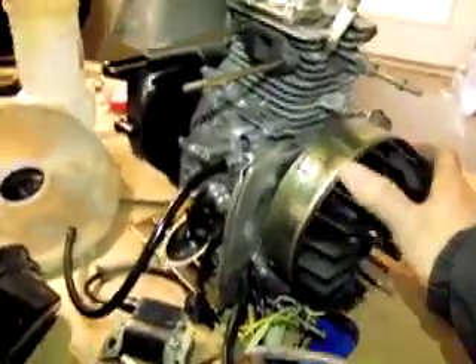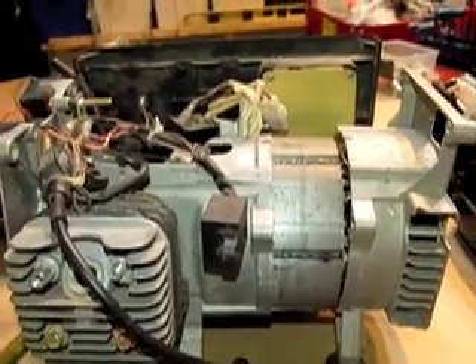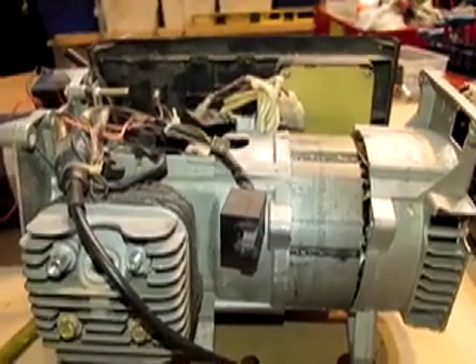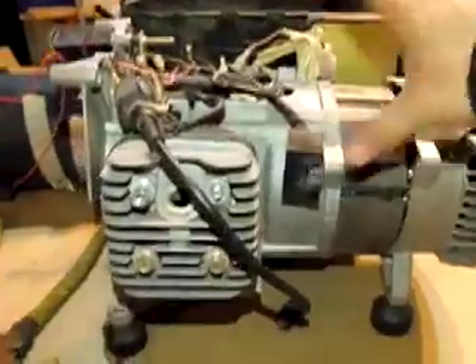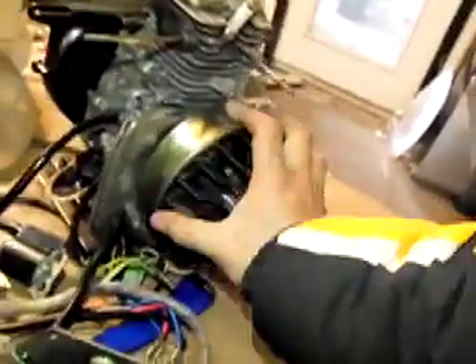You can see it's got room for a gas tank and the whole generator sits right there. These are quieter and they produce a cleaner power. If you have a voltage drop and you have sensitive electronics hooked up to it, or stuff that requires a very good clean frequency, they either won't work on a regular generator or they can get damaged if you put a heavy load on it. With the inverter generator, it can slow down to a certain extent and it doesn't have to match the speed as precisely, and this basically keeps your voltage nice and stable.